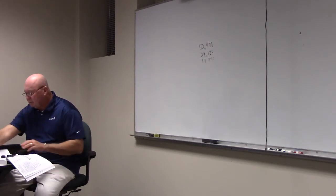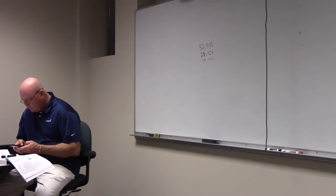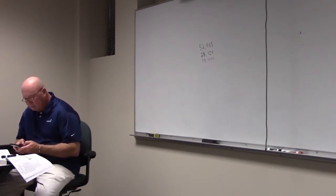So let's just kind of do the math. 7.5 times, let's say, 30 units, right? 225 times 0.24 is 54. Y'all come up with the same thing I did? Yeah. And so that would actually be 54,000, right? It's 54 kW.